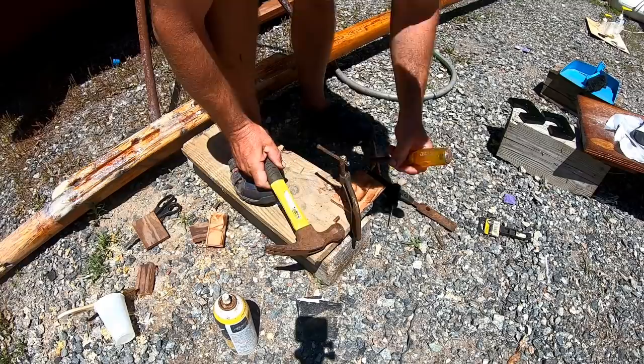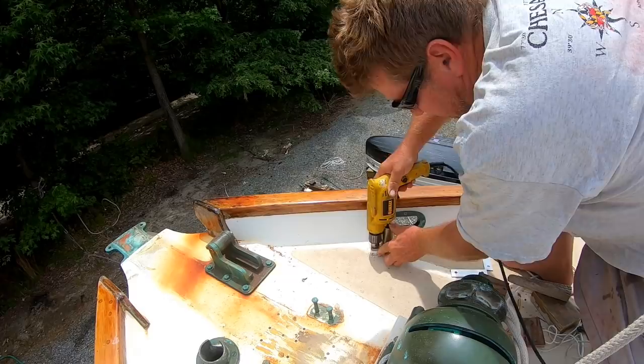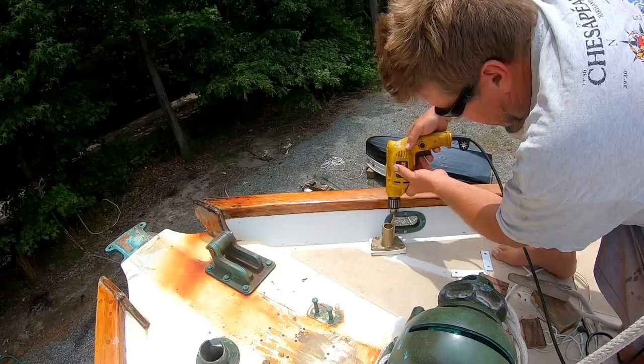I purchased the stanchion bases from Spartan Marine, and they are designed to angle the stanchions inboard at 5 degrees. However, I've reversed them so the stanchions will angle outboard, and yet that still doesn't look like enough, so I've constructed wedge-shaped bases to angle them probably around 8 degrees outboard.